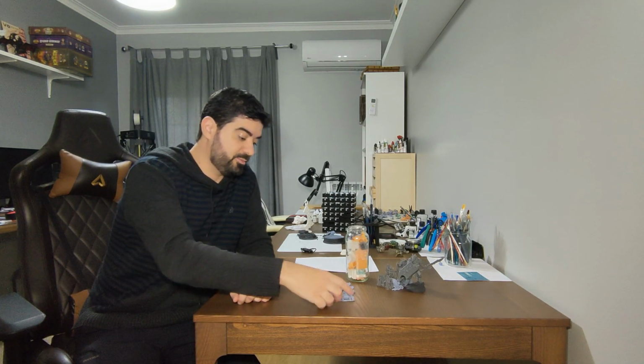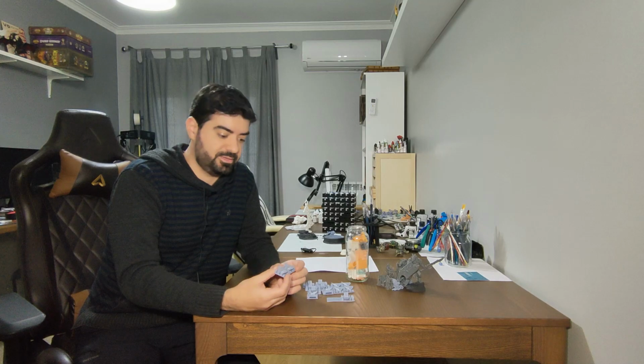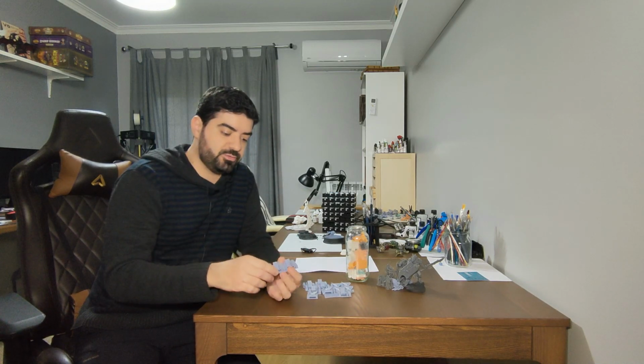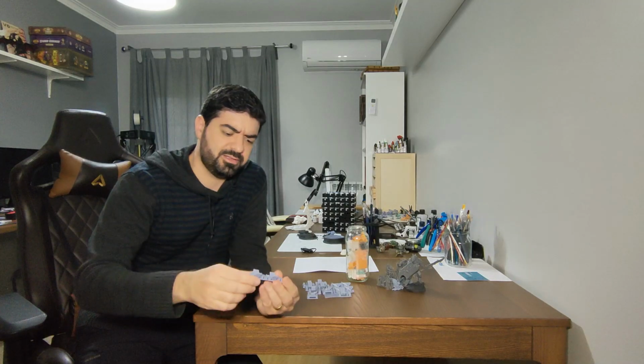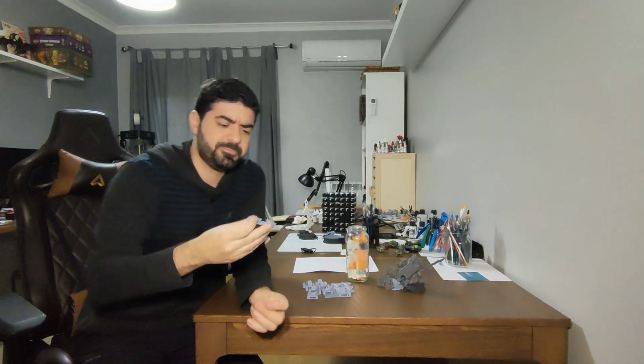But you ask me, oh, how that works? So it's one of the best ways to find resin exposure that I've seen in the market so far, and that's only on Anycubic printers. I do not see it in any other printer. Okay, so basically it prints 8 squares of these, and it's pretty complete. It has like a lot of parameters here for you to look at. And each of these squares has a different exposure time.